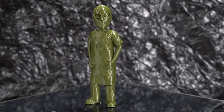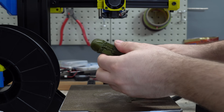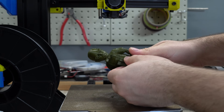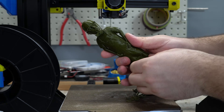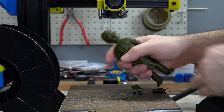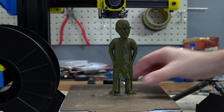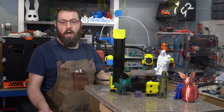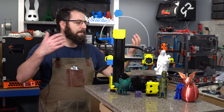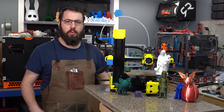It'll print a pretty good Benchy, and again this is mostly stock profile settings. I actually hit this machine with a lot of prints that required supports for some reason, and I will say it nailed them pretty good — the default settings for supports for breakaway is pretty clean. I'm sure I could do a little bit more tweaking to really dial in this machine, but I'm still running it pretty stock and it's printing everything that I'm giving it. This machine is obviously not enclosed — I believe they are working on an official enclosure for this printer.